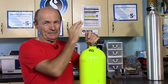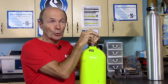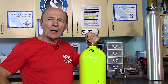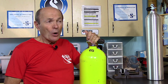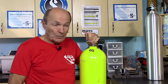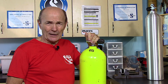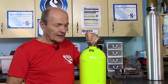Now one last thing. It was 3,000 psi, cool, room temperature when it left the store. What's the pressure going to be when you jump into the water off Catalina Island, or in one of the Great Lakes, or in the Northeast states? What's the temperature going to be? What's the pressure going to be? Right, it's going to go down. You can't avoid that. The answer is not overfilling. No, not overfilling.